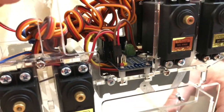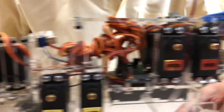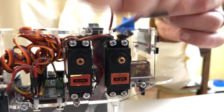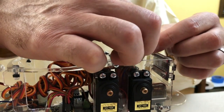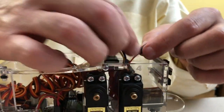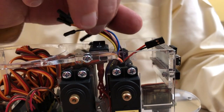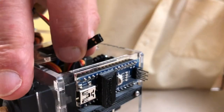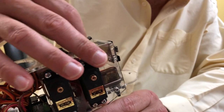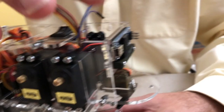These two lines up here are for the Raspberry Pi, which we'll get to in a whole other video, so I'm just going to tuck those down. Continuing to the back, the last thing to connect up is the Arduino, which is where most of these things come. The first thing I'm going to do is connect the power — this is the power that came off of the switch, and it should go down and connect right to the power switch. You should get yourself a very good map of your Arduino Nano. The pins are labeled but you want to probably get a good drawing and refer to that to double check everything. The power is these first two pins on the bottom: power supply then ground.